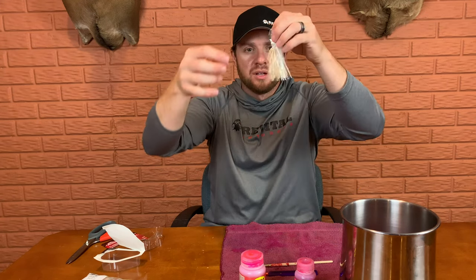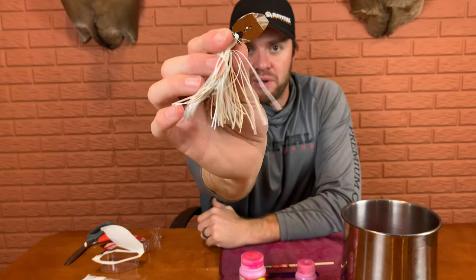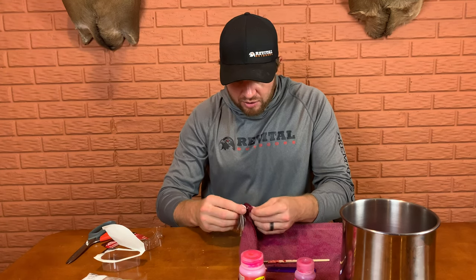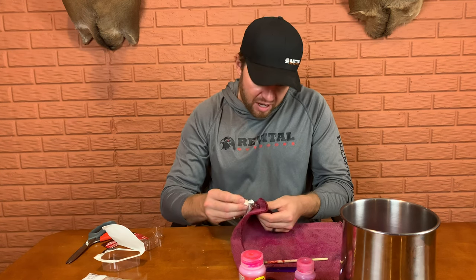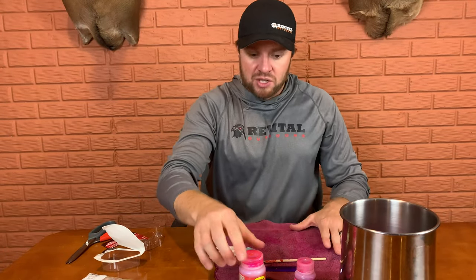You can see now the majority of that skirt is separated. Next, on the blade itself you can see some fingerprints — there might be residual oil. You could rub it with some alcohol to get the fingerprints and oil off. The reason you want to get it clean is so the lacquer actually sticks, because this is a really smooth surface and if you don't clean it, it won't coat well. So I'm just going to rub my cloth on the blade and the head to get all the fingerprints off.